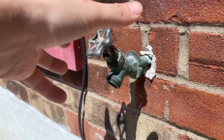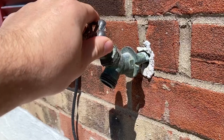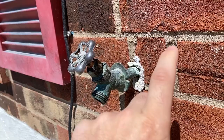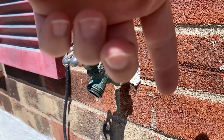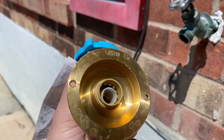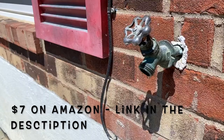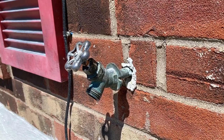A lot of faucets outside go all the way back inside the property and you are able to unscrew and replace the entire piece. But on this one specifically, it is just a copper pipe that is welded onto another copper pipe. If I tried to forcefully unbolt this faucet, I will probably crack a pipe somewhere inside of the wall, and then I'd have to remove the bricks and the wall from the other side, creating a way bigger mess. Instead, I ordered this half-inch faucet on Amazon — it has a shark bite. All we have to do is cut the pipe right here, clean it off with some sandpaper, and then use the shark bite and just pop it in place.